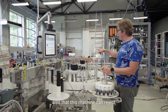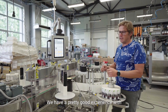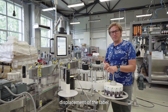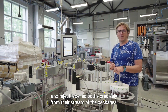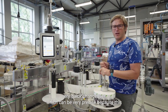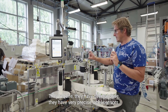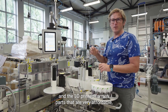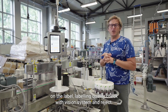What is also very important is that this machine can reject — it can make quality control of bottles very efficiently. We have good experience with vision system labeling position control, and we are able to detect minimum displacement of the label and reject a mislabeled bottle precisely from the stream of packages. So we can operate at 100 ppm with very quick changeover. The machine has servo drives and very precise label sensors, so precision is below half a millimeter, with 3D printed format parts that are very affordable. High labeling pressure prevents bubbles on the label, and labeling quality is checked with a vision system and reject.